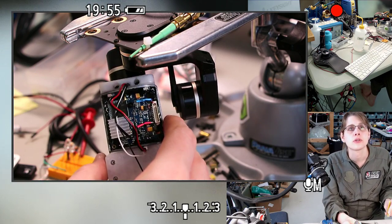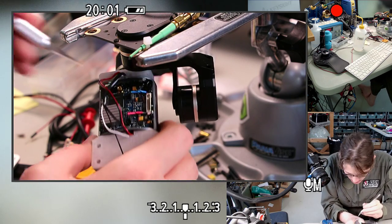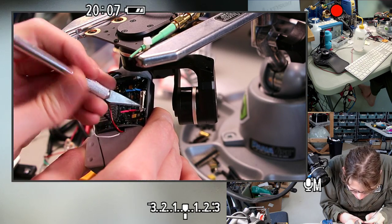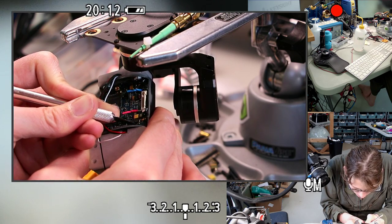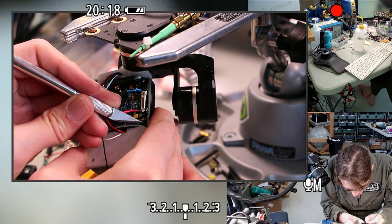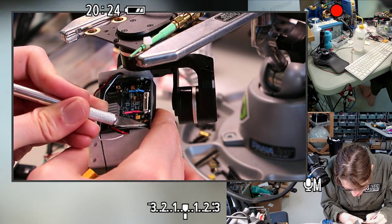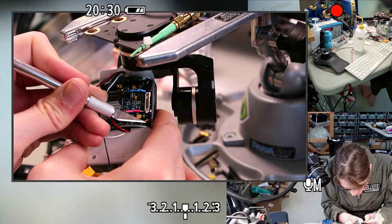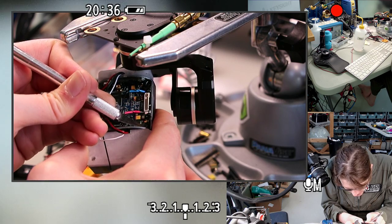Quite keeping the light tightness in the corners. I think this might end up being roughly equivalent to if I had just not even tried to put any hot glue in the corners. So, oh well. And if you're wondering why I don't use the isopropyl for here, it's hard to contain that technique for something where there's a continuous run of glue, because it'll just want to seep under all the hot glue that you have in the area. So I find it harder to use the hot glue removal technique for small adjustments.